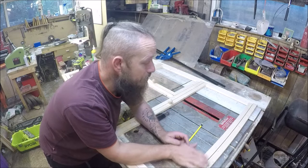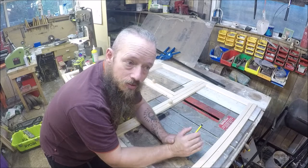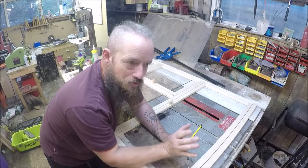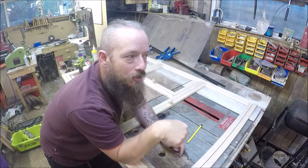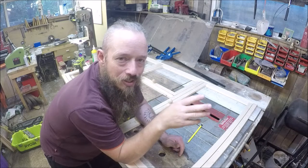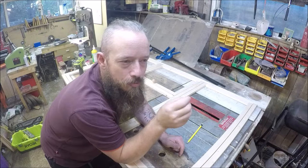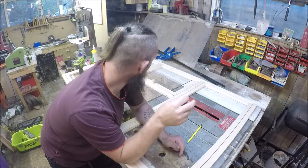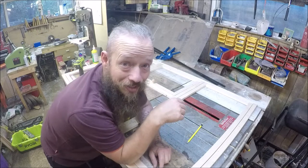So next step is to sand it, paint it, and then put the fabric on. Now, I took the frame to the bedroom to, bear in mind, I measured it across the bottom and up the side. I took the frame up there, and it turns out that the window isn't square itself. This is square, and the window's not, so I've got to make some fine adjustments to slot it, but it's not too bad. It's quite easy. Right, let's get on.